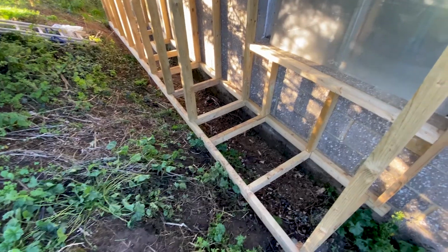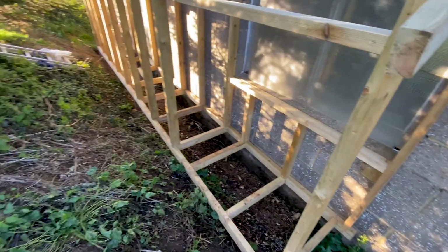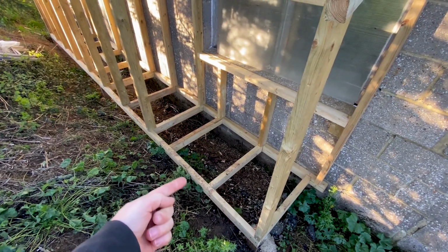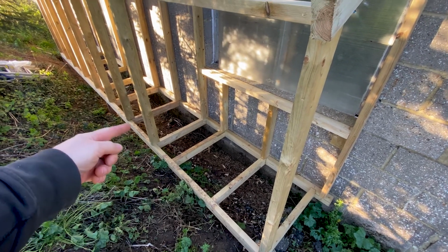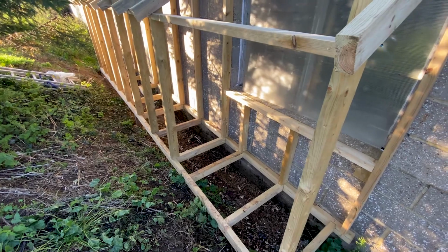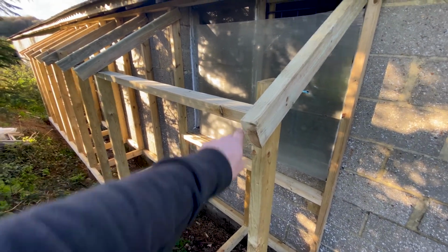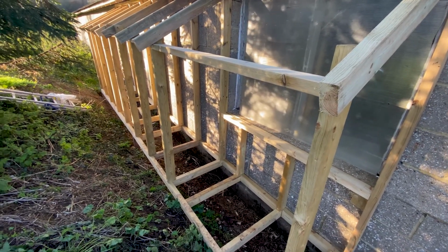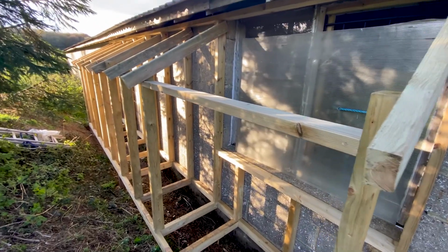And throughout the year I'm going to have to weed kill all the way across the edge and around the sides and stuff. Make sure that no plants start lifting up. As you can already see, they're already touching. I'll clear them off obviously, but otherwise the wood will start to rot, I'd imagine. This is between C16 and C24, like there's a mix of stuff I had lying about, and it's obviously treated, so hopefully we won't have too many problems.